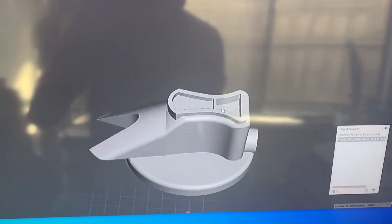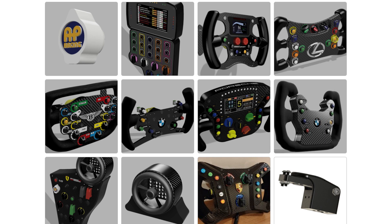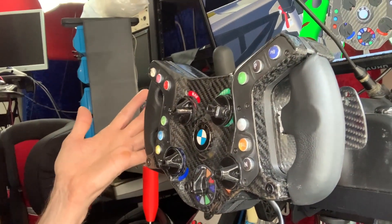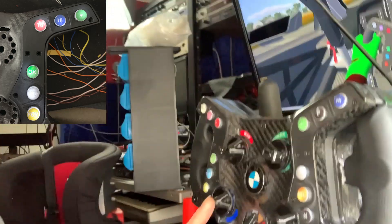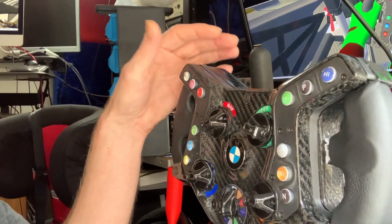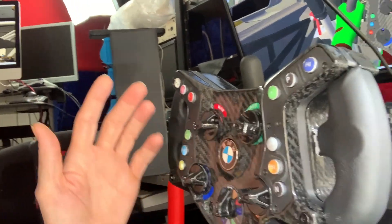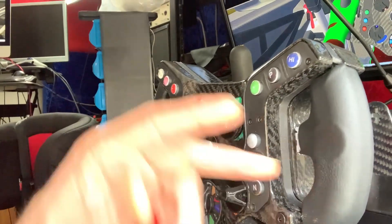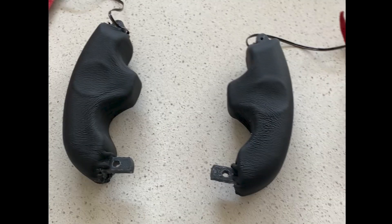I had to design this knob from scratch because I wasn't quite happy with the one that was in the instructions. I got the wheel plans from a very clever man who does beautiful wheel designs called Sim Wheel Designs — I'll put a link in the description — but I basically got the 3D printing files and then modified them like mad to suit my purpose, because I've got backlights in all of the knobs. I've actually done a custom knob here, and the internal design had to be totally modified to do the electronics I wanted. There are basically 46 controls on the front panel — all push button and rotary encoders. It has a slip controller on the side, a diff slip rotary encoder which you can operate with your thumb, and traction control on the other side as well. There are even vibration motors in the grips.